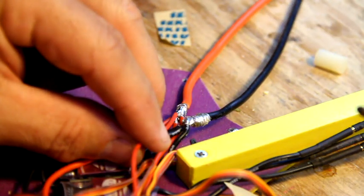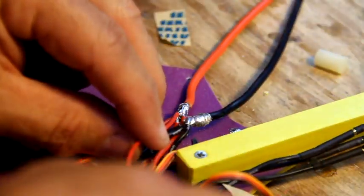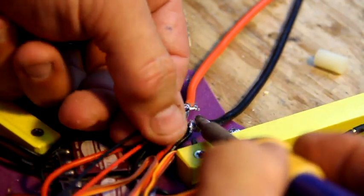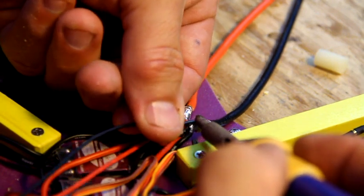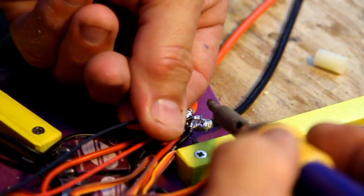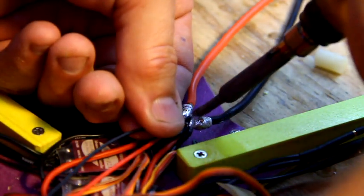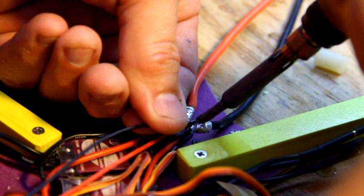And then on the back side here, I'll just touch the soldering iron because it's got a ton of solder on it already. And you're not going to unwind these wires just by doing this, but you'll basically just kind of touch it and get it to adhere to the actual blob of solder that's already on there. Oops. It's hard to do trying to keep out of the camera's eye. That's a really bad solder, but I think it'd be plenty solid. Oh, I was wrong. Got to leave it long enough to get it to kind of melt into the other solder.